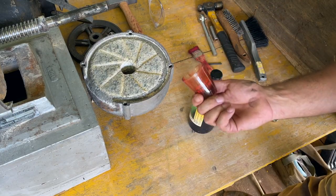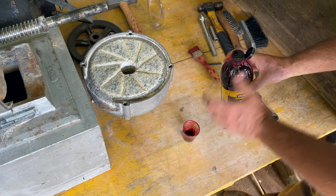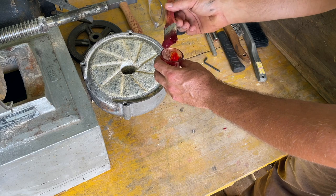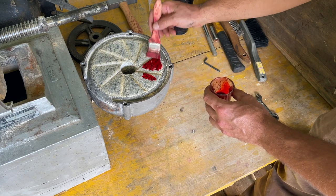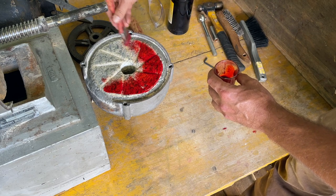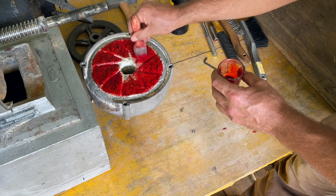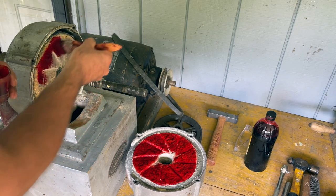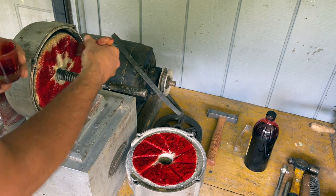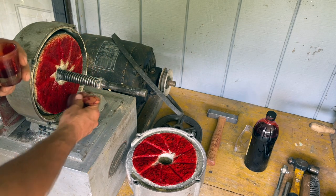What we're going to do now is pour a shot of red food coloring. Red food coloring is what we use to dress our millstones. In the olden days, they would use red iron oxide mixed with water or kerosene oil and paint it on. You paint all the furrows and the lands with red food coloring, and then we'll let that dry, put this mill back together, and run it without grain. We'll adjust it so that those stones barely touch together - just bump them a little bit, run it maybe five minutes or so. And then we take it back apart.